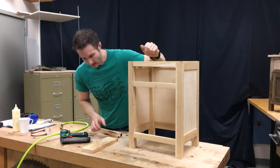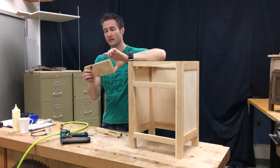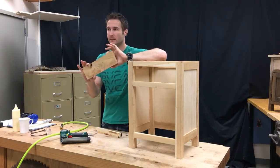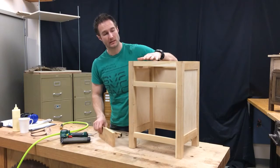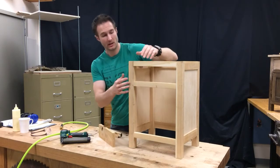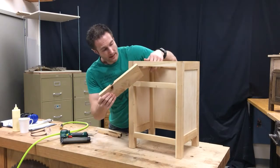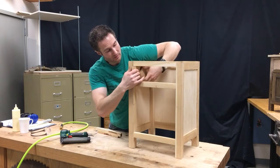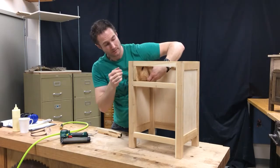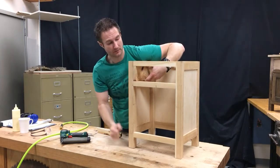The second thing you need to do is prepare the two sides of your drawer stock. In theory these are going to be cut to final size at exactly four inches wide — but double-check this. At this step of the project you're starting to make things that are custom-sized to fit what yours actually ended up being. So measure exactly what the distance is here, and that's going to be the width of your drawer. The final length of your drawer runs from the back rail — right where the drawer bottoms out at the inside of the back rail — all the way out flush with the front face of your project.